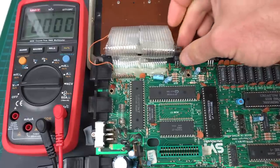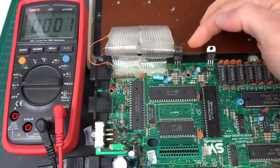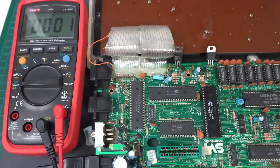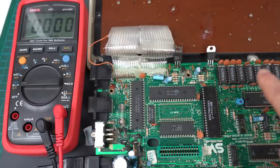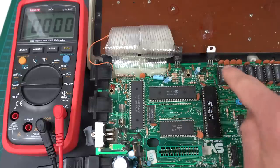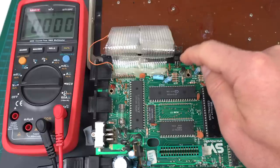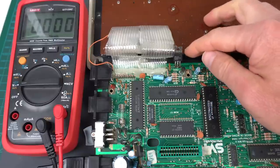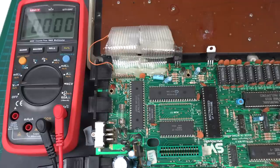That's not good. Could it be that... yeah, this is really hot. Normally I'm used to being able to run 7805s without a heat sink for a few minutes and yeah, they get hot, but that's fine. Maybe there's a lot of current draw, especially now that we've hooked up the video RAM to also use the 5 volt rail instead of the 12 volt. So maybe there's extra demand on the current being drawn from this voltage regulator and it just heats up really quickly. As it crosses a certain temperature threshold, it just can't function and drops the voltage. At least it dropped the voltage as opposed to going up and blowing up the whole board.